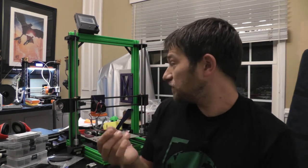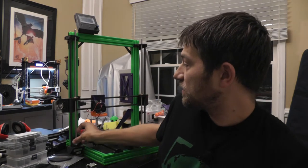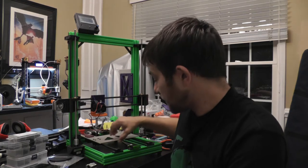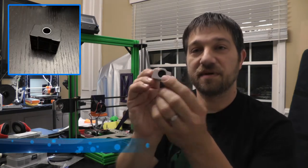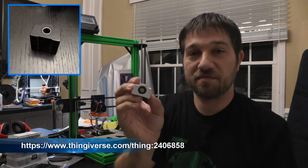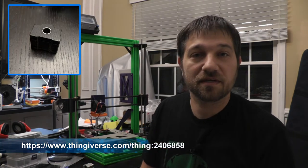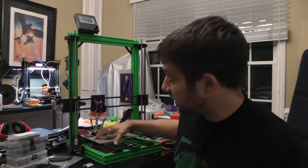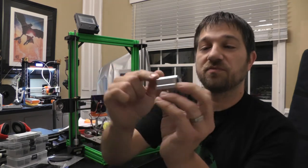In fact, they move very smoothly. And as we were saying, in this direction, they move very well. So what did I do? What I've got here is I 3D printed plastic versions of these holders, and then made the inside dimensions 8mm to where I could press the bushings into them. So that's what I have here. These are mounted directly below the plate. They have two bushings each, one in one and one in the other.